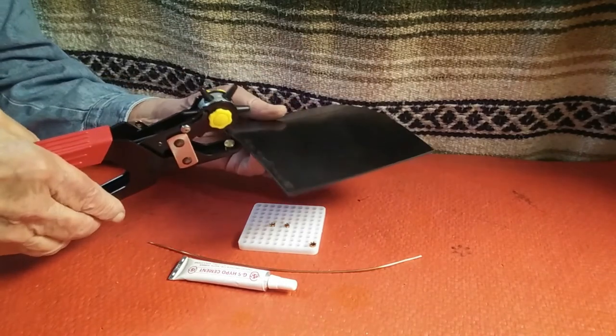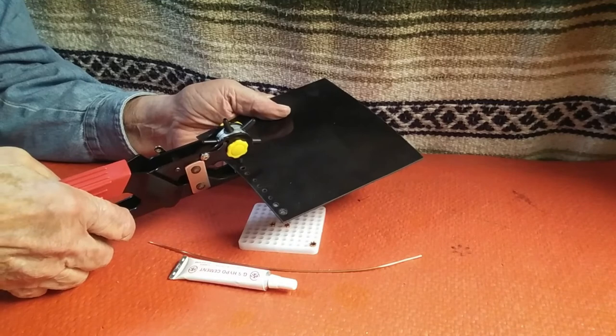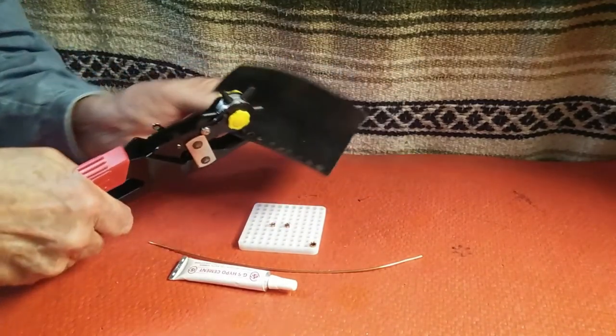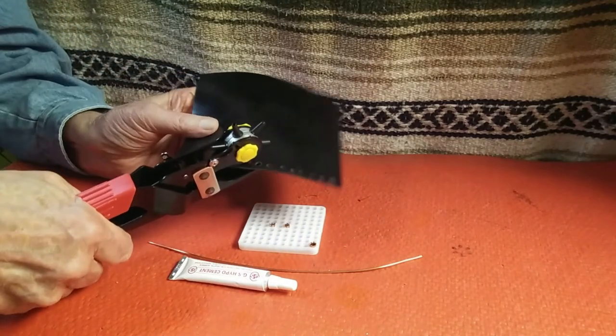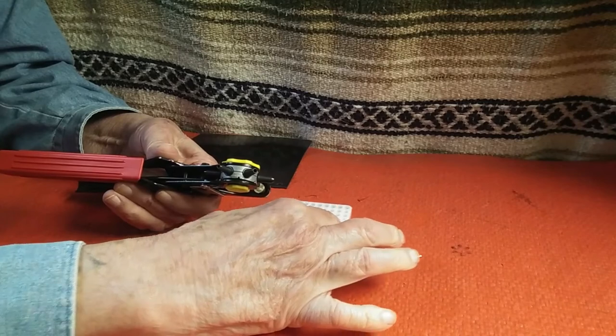Of the two ways mentioned, aluminum can and copper sheeting, the first is the least expensive. However, if you are going to make your own hot number 11 percussion caps, way number 2 would be the way to go, as the copper forms better.